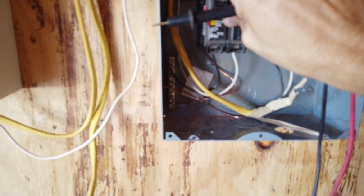There it is. Turn this main breaker on, which is our input. That will turn on this bus bar, and then these two turn on the auto transformer. Should have 110 volts here. Look at that, 114.5. This breaker right here is crappity crap. I need to put something in this spot because that one's not any good. But these 230s, of course that breaker's fairly new. So there we go, it's working.